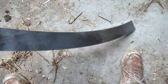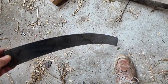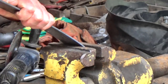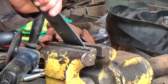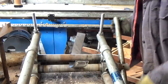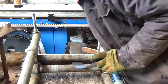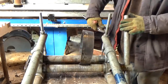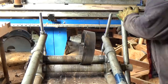Anyway, you spurred me on to make another set of wheels, this time with tapered treads, so now we can see how they compare. So instead of a straight pipe shape for the tread, this time we'll need a cone shape. Straight away this design is more complicated and uses more material. You'll need an accurate drawing and a slip roller, because rolling a cone is a little more tricky than a straight circle — though it is possible if your steel is not too thick.